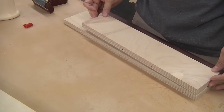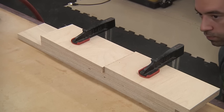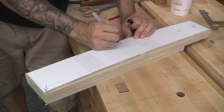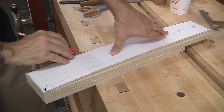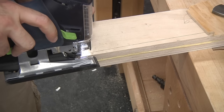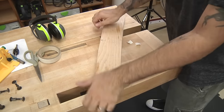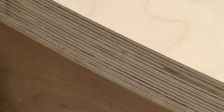Spread a good amount of glue on both pieces and use a few brad nails to help prevent slipping. The thing to remember is that you'll have left and right versions of your legs, so always double check yourself to make sure you're making mirrored pairs. After the legs are dry, we can cut the curves. There are two reference points: the inside bottom corner and the outside edge about halfway up the leg. These points need to make contact on your blank's edges and everything else will fall in place. Trace around the template and make the cuts using the jigsaw. You can either sand the legs to their final shape or use a router with a flush trim bit. You'll need a fairly long bit to get this done in one shot. And there are our four legs.